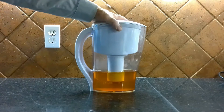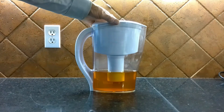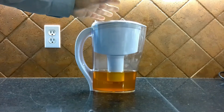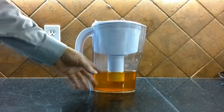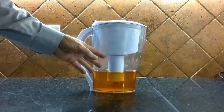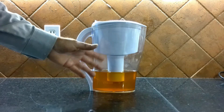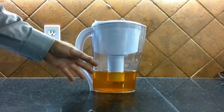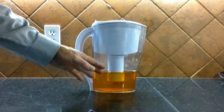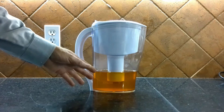A question that is often posed to me is: when do you know when to retire your oil? This oil right here has been through my freeze dryer probably at least 10 times. You can see it's getting a little bit on the darker side. I'm a Black Gold vacuum pump user and Black Gold starts with a little bit of a yellow tint, so you can kind of see this oil is getting a little bit darker. But how do you know when the oil is too old to continue to use?